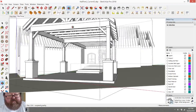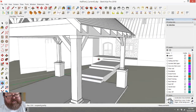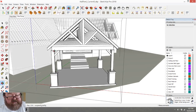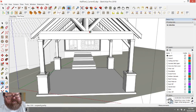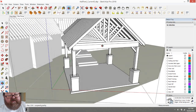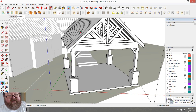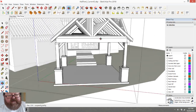with the beam all the way around, because what you can do then is you got your angle brackets, and what you're trying to do with these brackets is, and they may need to be a little bigger now, you're trying to stabilize this thing, because the trusses will stabilize the roof, this whole thing from here up, but these are going to want to be like chicken legs wobbling around if you're not careful.